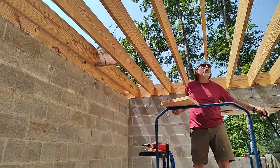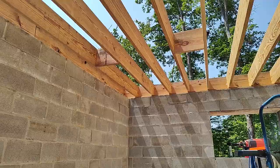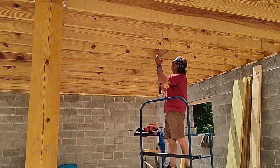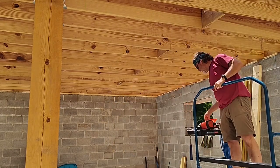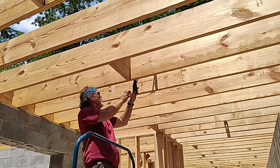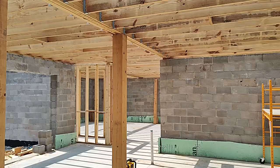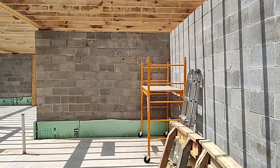I'm not sure if other people do that, but it's not really any more effort either way. I just felt that while laying down the subfloor, if a joist were out of line or a piece of sheathing wasn't landing, it would give me more opportunity to efficiently address it rather than having to redo blocking I'd already put in. In general, if you're doing 16-inch on center as I am here, the blocking is going to be 14.5 inches, defining the space between joists — but if the joists are wavering I can adjust those measurements slightly. With the exception of a few punch-list items, the entire subfloor and support structure is complete and ready for sheathing.